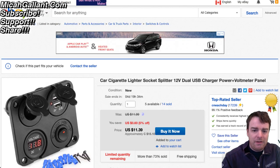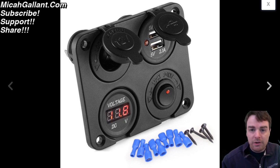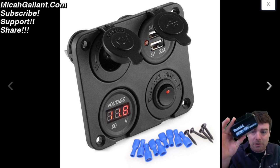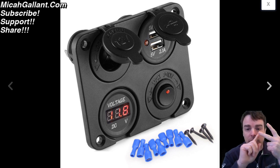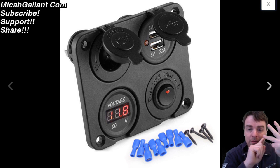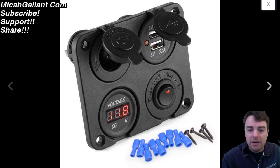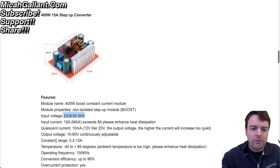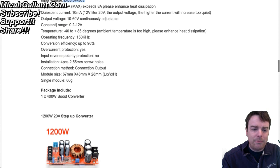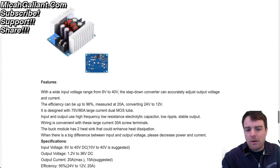On top of that, you can get this one here and plug this in. This will run off the 13 volts regulated by that step down converter. And then you have a 12 volt socket, you have USB chargers, you have a voltage meter, and you have a button which you could use to turn on and off the whole system, or turn off some other device. This converter that I'm looking at is a 300 watt unit, 20 amp, 300 watt step down. Here is the step down converter.